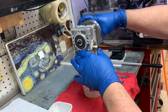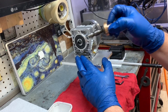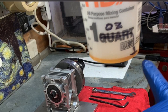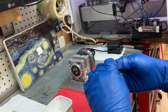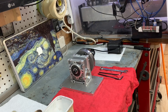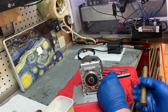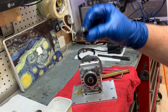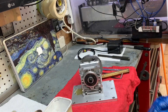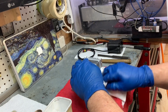I'm going to show you that there is not a quart of oil. Now you can see I have my eccentric bushings on already — yours will have the factory bearings. I scratched off "one quart" and wrote "one ounce," which by the way is two tablespoons. Remove your front bearing and put it aside — you are going to need to measure it. Even though I've provided sketches, I'd really like you to verify that your system is the same as mine. Now tapping out that rear oil seal — it's more of an oil cap. Try to be gentle with it because I can't find that replacement part anywhere. Remove this rear snap ring once we clean up the oil spill.